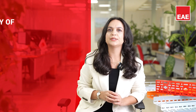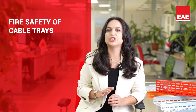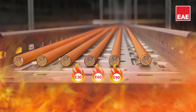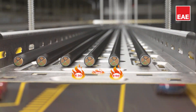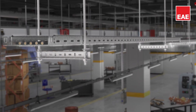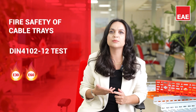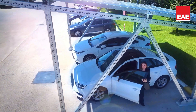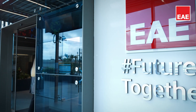fire safety is an indispensable part of electrical systems. EAE cable trays are tested in accordance with DIN 4102-12 standards in collaboration with prestigious cable manufacturers and are certified in the E30, E60 and E90 classes. We maintain our responsibility towards the environment, at the highest level, with the highest quality and most reliable solutions.